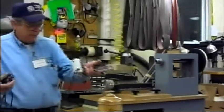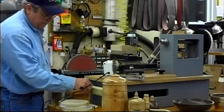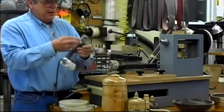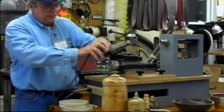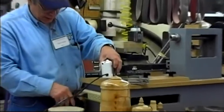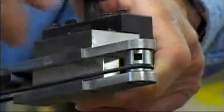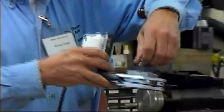This is my favorite cutting frame. Put the belt on when you run. I don't leave the belts on because I don't want to keep them under tension all the time. If you can see the cutter, that's what's going to actually do the cutting. The reason it's called a horizontal is that it names things very basically. That spins horizontally, and if I've got another piece that I can bolt in here and actually turn it that way, then it becomes a vertical. That's how I do these patterns. It flips up and it does a thing called phasing. And I'll show you that too.